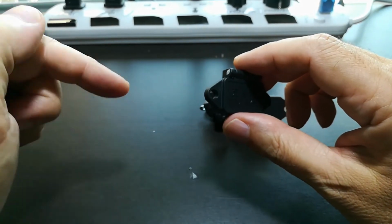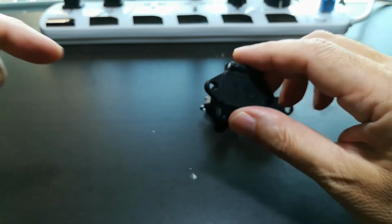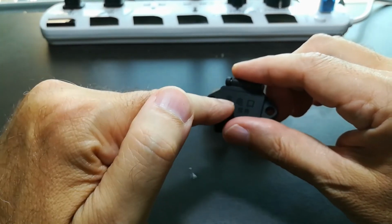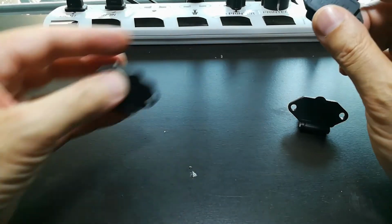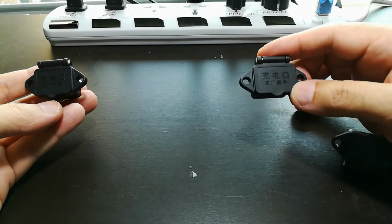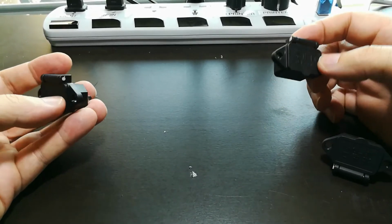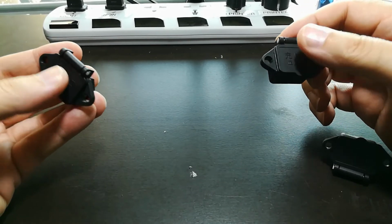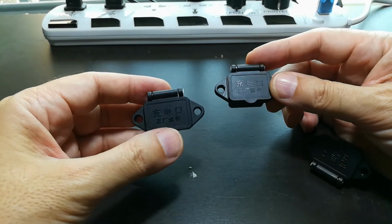The charger that's in the bike now, it also has a connector almost exactly like this, but it's the output of the charger that goes in here, and the charger is changing it to 60 volts DC. So on the bike, I'm going to have a 60 volt DC input and a 230 volt AC input. So I'm going to install them in different parts of the bike and label them, because I do not want to have the chance to plug the wrong wire into the wrong thing, because that will ruin your whole day.